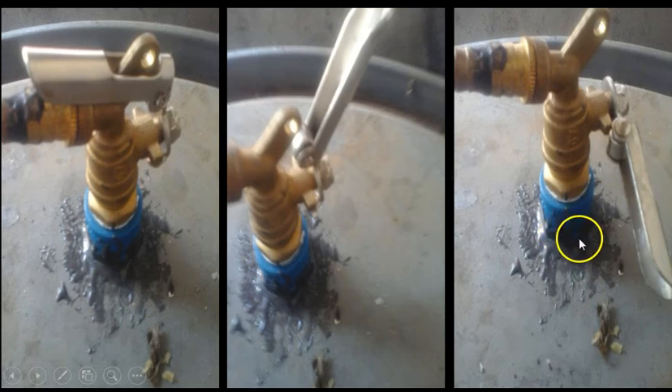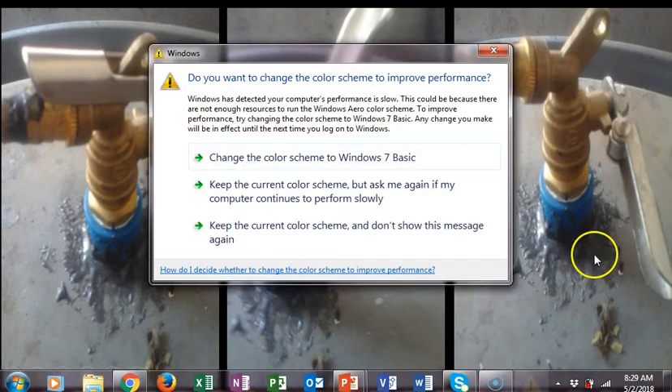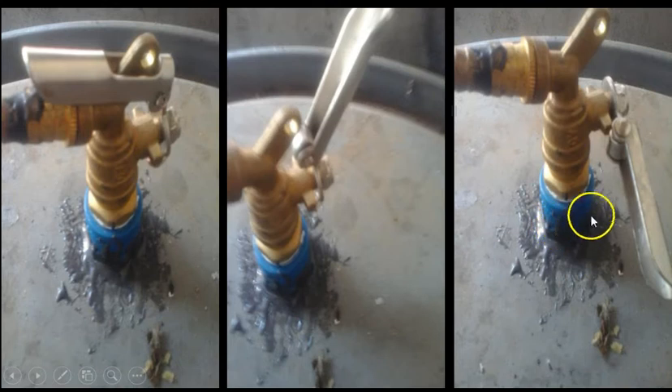In this area, this is where I drill in the correct size of the PVC pipe. This is a standard size of the PVC pipe for water. The gray one is the heavy adhesive type which I got from the hardware. To check if there is air leaking out from the biodigester, just use a liquid soap or liquid dish soap here. If there is a bubble that comes out, it means there is a leak. Anyway, if you use the heavy adhesive type, you don't need to worry about that.